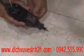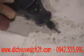Here you can see we have a floor that's had the wax removed from its surface, and this is actually old epoxy that you see here being drilled out. To do this, we're just using simply a Dremel tool with a titanium bit. Now, this may seem tedious, but the new epoxy that goes in these holes matches the stone's color and ensures the final product is desirable.